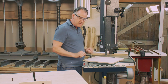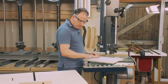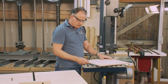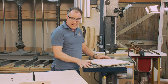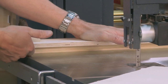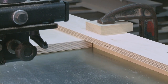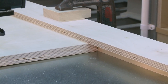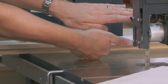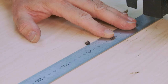This jig is quite heavy so I've got two things set up to help me. I've got a roller over here - this roller is very good because it's a bearing so you can use it in any direction, and that's going to help carry some of the weight. If you don't have this kind of setup, on the other side I've got a piece of solid timber which has been machined fractionally thicker than my plywood, so my plywood is going to tuck underneath here. There's a piece lapping over and that's going to stop my plywood from kicking up - I don't want it to jam in there, it's to assist me, not to snatch up.